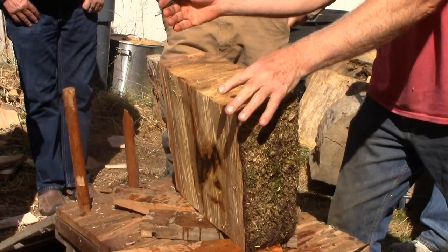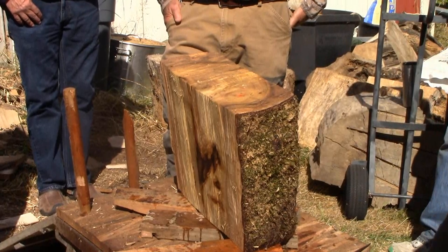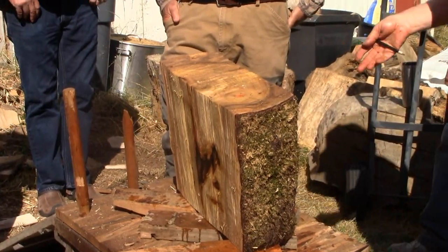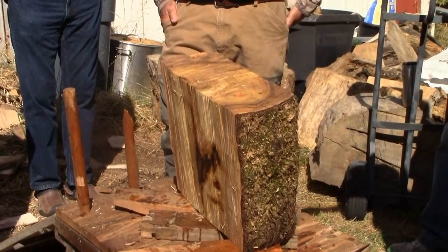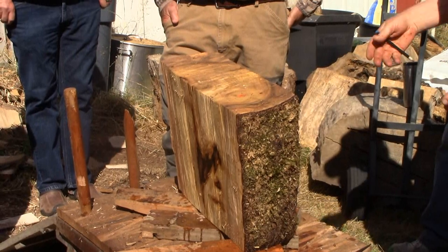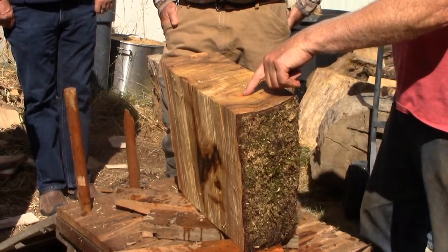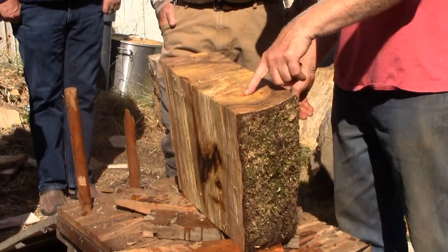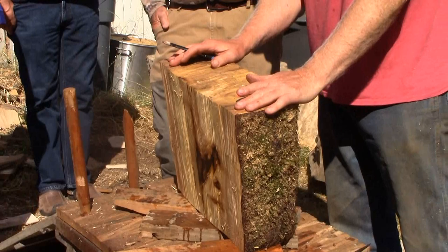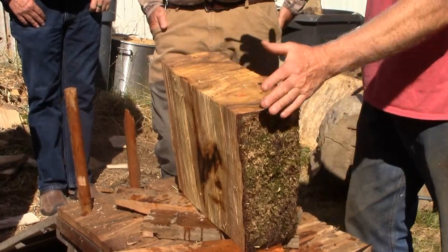There's another one here. Can I ask you a question? Go for it. When you say you have to live with it, I love knots. I love character and I love all that stuff. And my dad did too. My dad liked the ones with bark inclusions and holes and everything. I turn functional gallery bowls. The problem with pith is they like to crack. Oh. And you can dry this. So we're going to rough this out today. Say we rough this bowl out today. Yeah. Next summer, it'll be dry, all right? Say a year, roughly, for Myrtlewood.